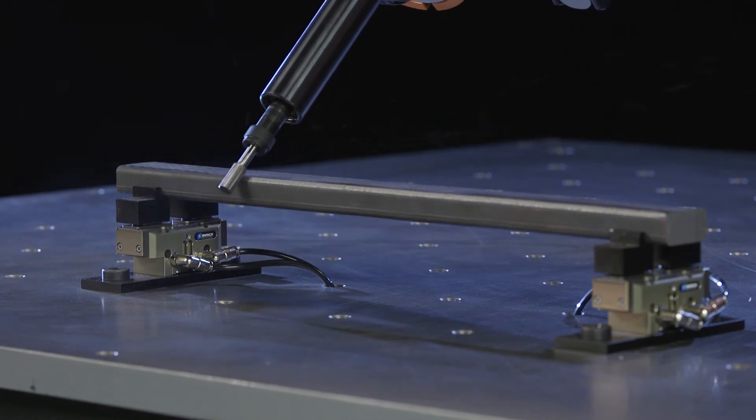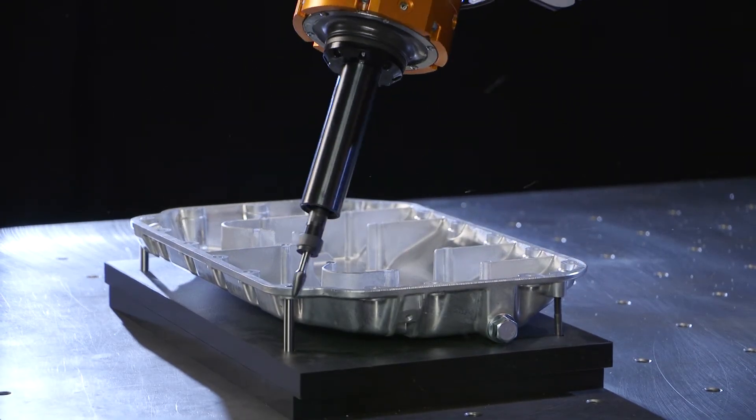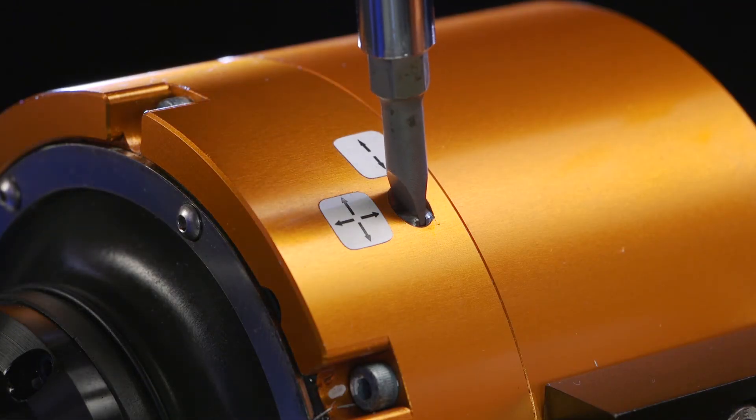A robust vane type motor can handle tougher materials like cast iron while also being able to deburr flash from softer aluminum. XY pivoting compliance gives you 360 degree joystick type movement with a single turn lockout to reduce that to a pendulum-like single plane motion.